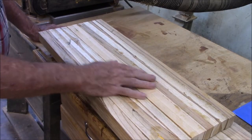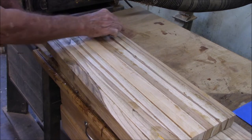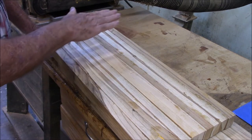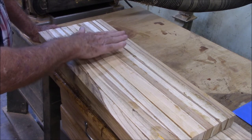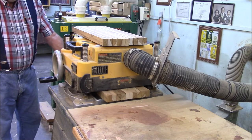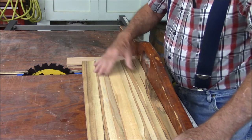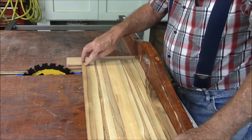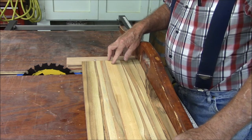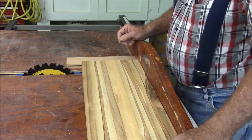I'm going to cut these blanks into inch-and-a-half strips. This is going to become the gluing surface, so this has to be perfectly flat and correctly sized. We're going to run this through the thickness planer and smooth out both sides. In this operation I've got a stop block over here, and I'm going to be cutting off strips that are a little under an inch-and-a-half. I'll cut all the strips and then we'll have to glue them together.